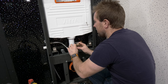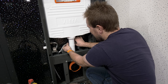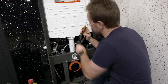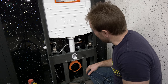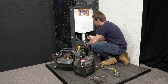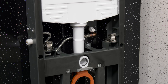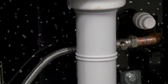Now let's see if we can get this in without having to do an over. Oh, look at that — there we go, lovely. Don't you love it when a plan comes together? So now I'm tightening up all the compression fittings, every fitting I can find. Now I'm just gonna go and turn the water on quickly and we're just gonna do a quick pressure test before we move on with the rest of the job. The water's back on, this valve is off. No, we're all good — that just gives us the opportunity to make sure that all the pipework we've just done is okay. Ready to go onto the next stage.